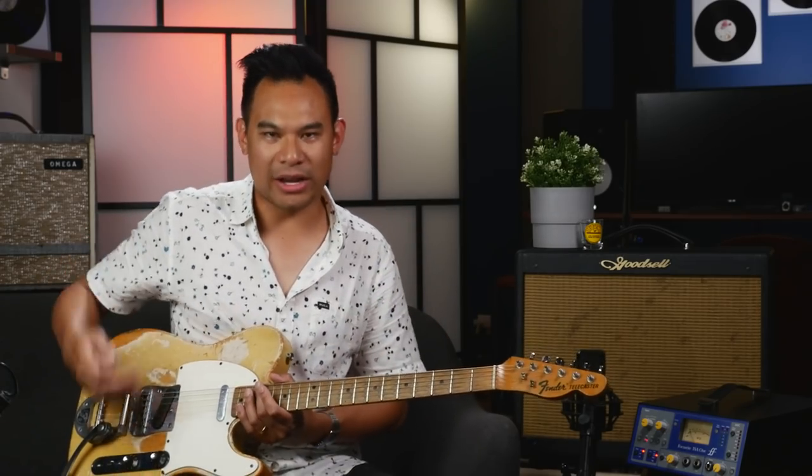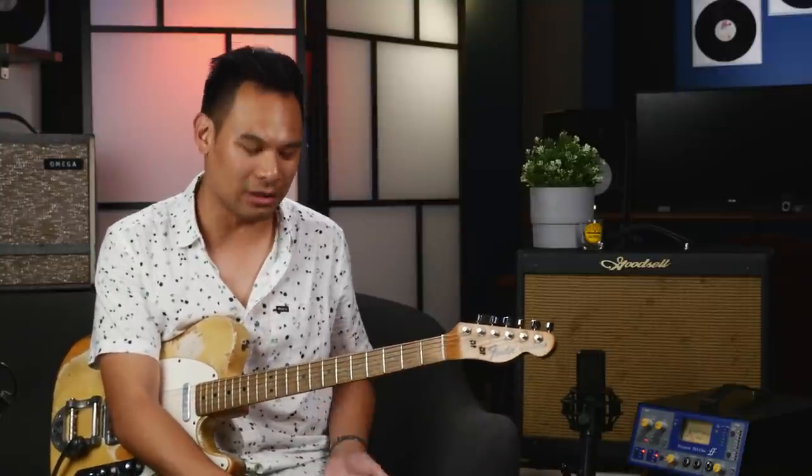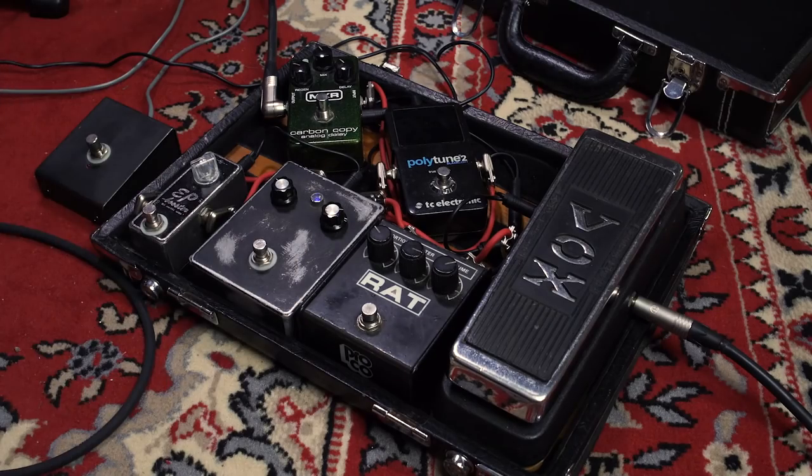This really sticks out. I made my own Boss Tone, only I've done a bunch of little modifications to it. I changed the input caps, some of how much power is going into it, and screwed around a little bit with the clipping section to get it right where I wanted it. A little bit warmer than the original, not quite as spitty, but I use this pretty much for any solo, or if I want things to get gnarly, definitely this pedal here.